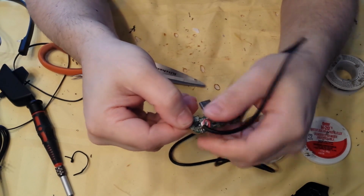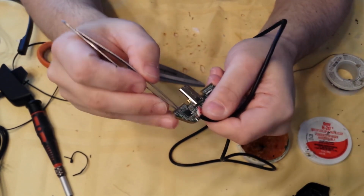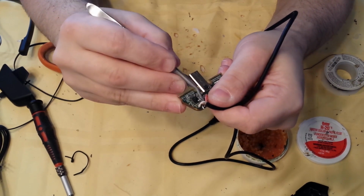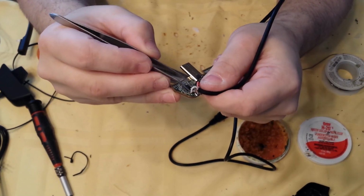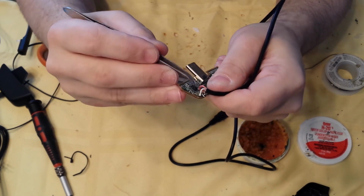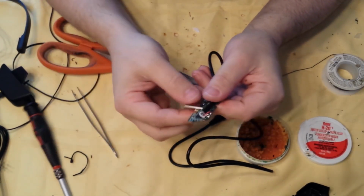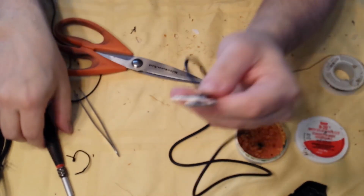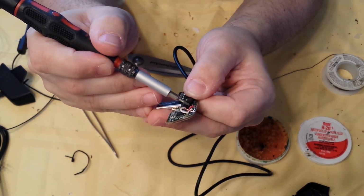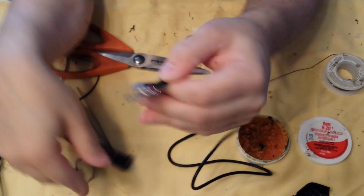Now, bend your wires forward. Carefully, you don't want to rip them off the contact points. See this big resistor here? Grab your white wire and wrap it under the unshielded cable around that resistor. Then the same with your red cable. Put it right behind it and then lay them back flat. They should look exactly like that. Your unshielded cable is up high and it doesn't touch any of the electronics. It's across the 2 shielded cables. All 3 perfectly soldered.